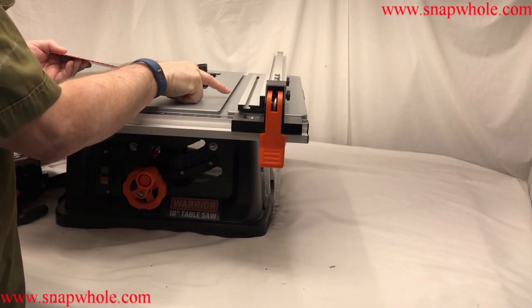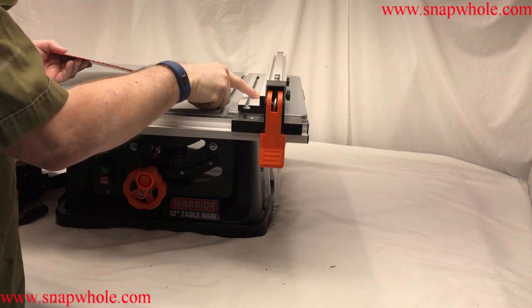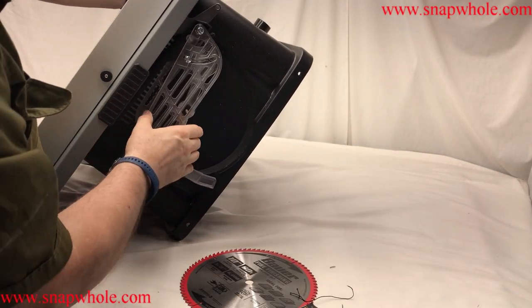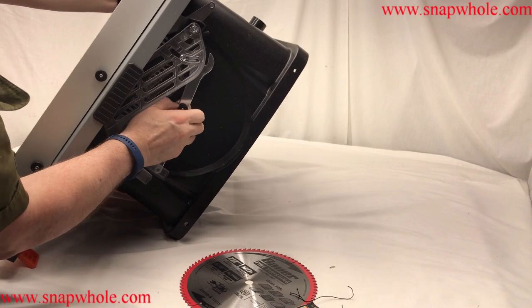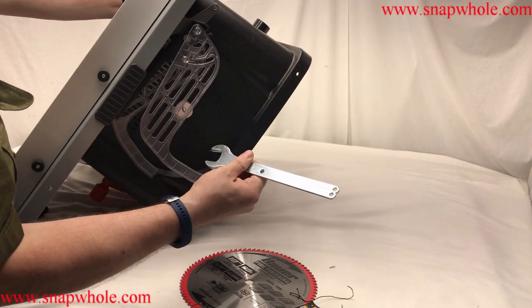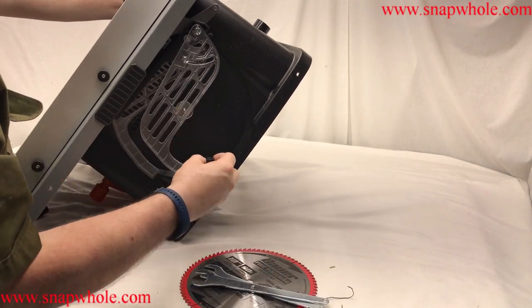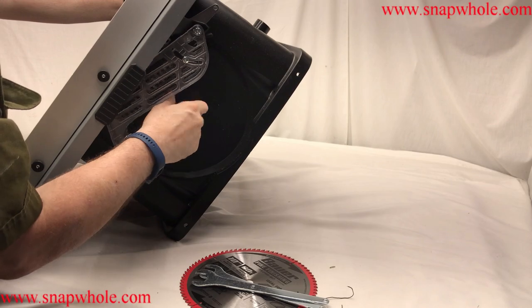Okay, so once the blade's in, the slot should be parallel to the blade. And the fence should be parallel to the blade. If they're not, then we've got to adjust things. Of course, when you want to do something with the blade, you've got to take this off in the center. There's a nut there. And you'll have two wrenches, same size, convenient. I always put that nut back on until I want to put something back on it, because otherwise I might lose it.